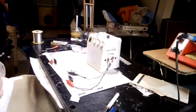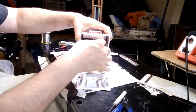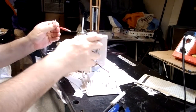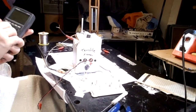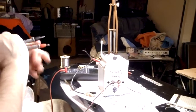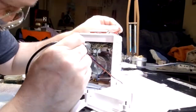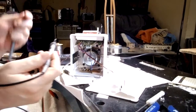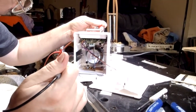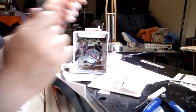So how did we make it? Well, the first thing we did was take the screws out and remove this so we could get the PCB out. Then I plugged a jack in here. This is cut. And I used a continuity tester, a deep cont. I was just talking about this the other day. We would go here onto our wire and then onto the board and start poking around. Oh, here we are. So then I knew that the ground for this input is the same as the battery ground. It's just universal ground, ground is ground. And then for the input, we went ahead and poked around until we found it. When we got that to beep, I used a red Sharpie and marked it.